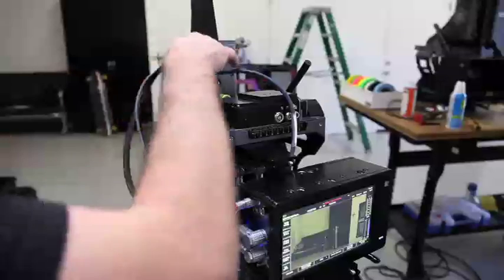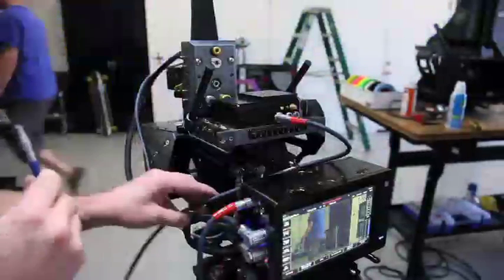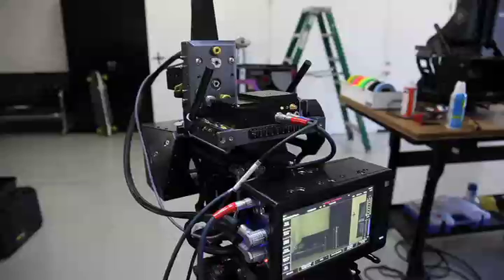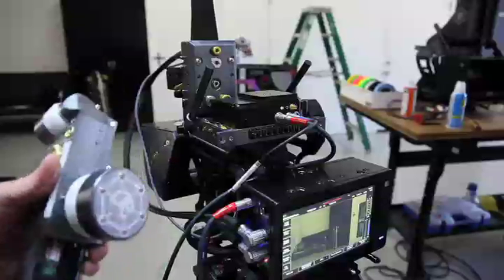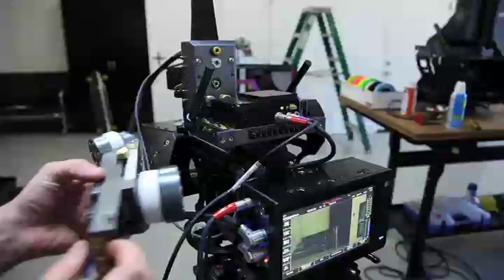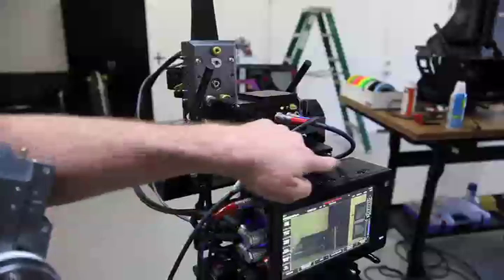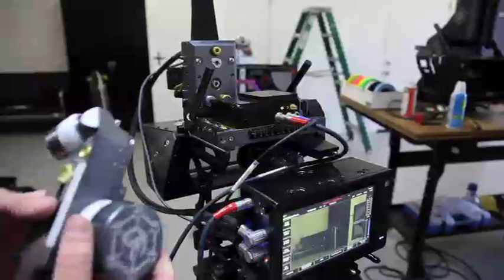Now that the rig has been aligned physically, we can go in and start doing some of the calibration of the handset. We're going to power the rig up using the two-pin power cable, and we're also going to add the CAN cable — this is for communication to the handset. Grab the hand controller and plug this into the wired port on the bottom of it. You'll notice the hand controller powers up. There's a button on the bottom that says initialize — we're going to use that to start the initialization process. What that basically does is allow the rig to calibrate itself, find its physical hard stops on the rig. While this is happening, make sure that you're not binding or pulling on any cables. Once the rig is finished in its calibration procedure, it'll basically be ready to operate.